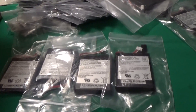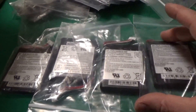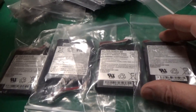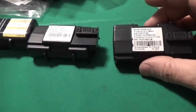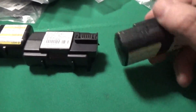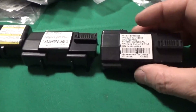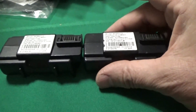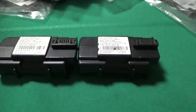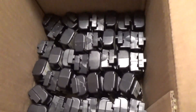This is going to be fun. The hardest part is deciding how I want to configure these and what I want to use them in, because I could make a really amazing portable battery pack with all of these. I may end up just making my own portable power unit. With these little guys — the 40 packs at 8.4 volts — taking them in sets of two to give me 16.8 volts would give me 44 amp hours of battery capacity with all of these.